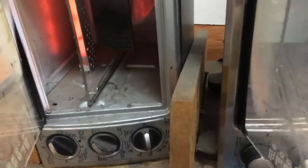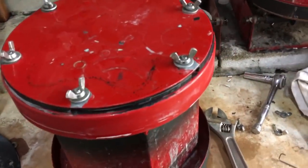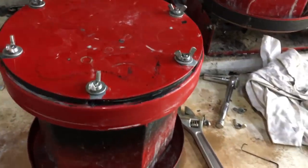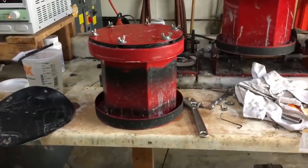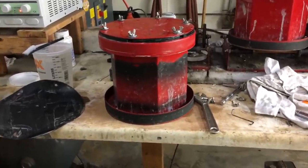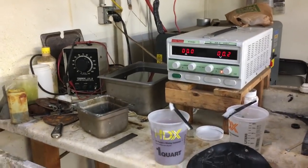I didn't videotape the application of the ceramic because it's really hard to do with only one hand. Right now the hardware is in the oven baking for cure — it'll be black. After ceramic, a lot of times if you want contrast, the pieces go in a tumbler. This specific knife will probably be in there for about three hours. The overall process is: blast, ceramic, tumble, etch, anodize.